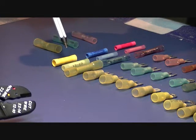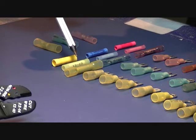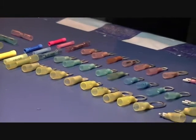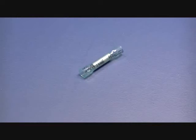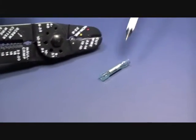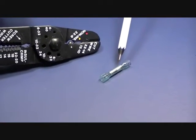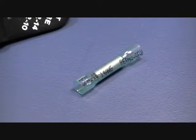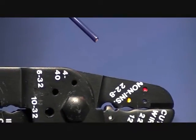Now, we talked about the vinyl, nylon, and these are all heat shrink connectors which are commonly called a crimp-on style. Now we're going to show you how to actually apply the connector onto the wire. First you want to strip the wire — you don't want to exceed the halfway point here, so we're talking maybe three-eighths of an inch. Strip no more than three-eighths of an inch off it; it depends on the connector.